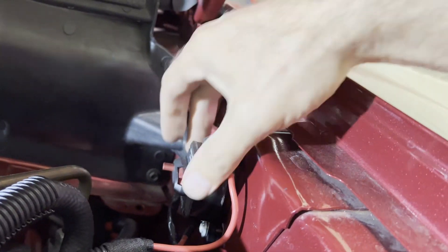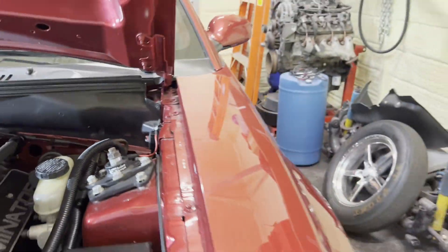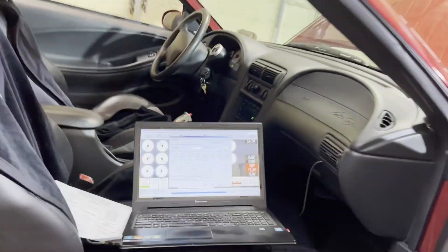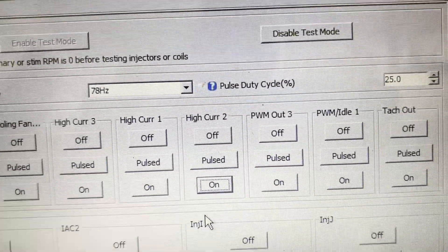The pump's running right now doing some testing and it's getting a little warm. One potential issue I'm finding is there's a circuit breaker up here wired in-line for the pump's power, and it appears to pop sometimes — it's just like a circuit breaker in your house that you pop and reset. I think that might have been cutting out at times causing us issues.